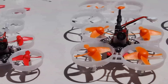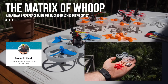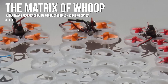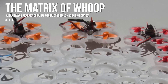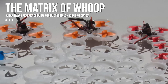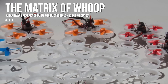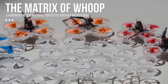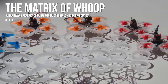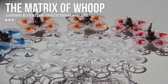Hello my friends, welcome to the Matrix of Whoop — a hardware reference guide for ducted brushed microquads. In this video I will give you the fundamental knowledge, the key specs you need to know to build, fix, or upgrade any ducted brushed microquad. Many people call many things 'tiny whoop' these days. For me, one of the main defining factors of the whoop is the 26 by 26 millimeter flight controller mounting pattern. Any Inductrix tiny whoop style flight controller can be mounted on any of these frames — and hundreds of others that have been made since the thing went viral in 2016.